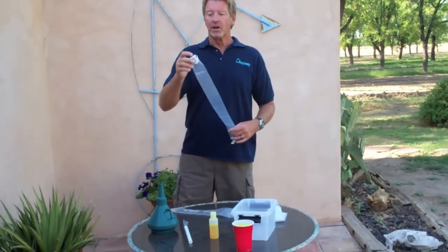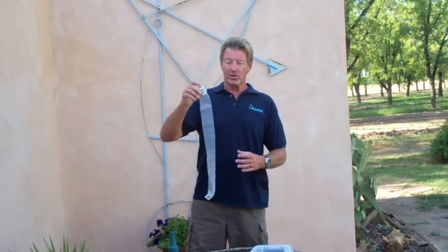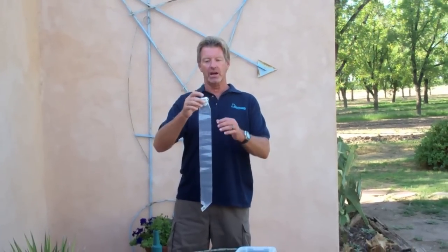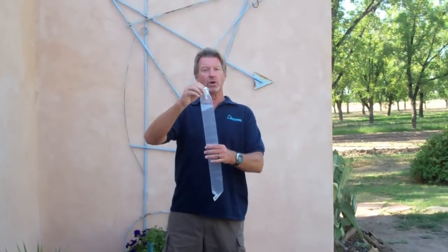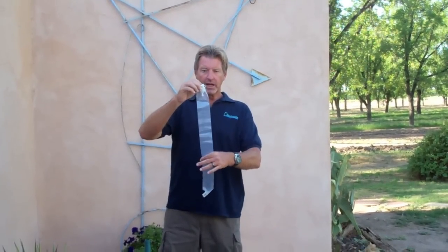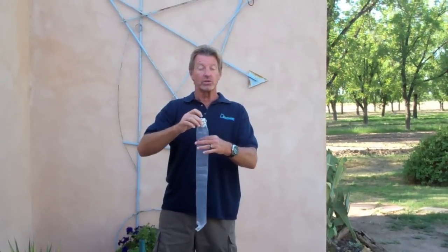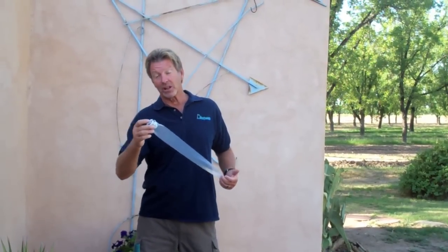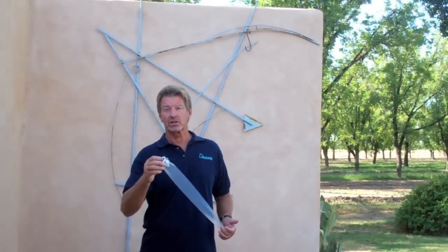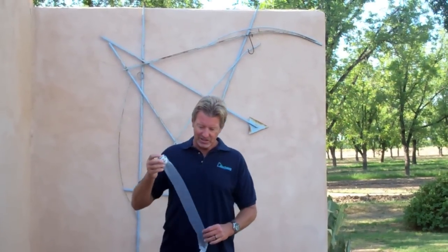As the product evolved, we discovered that this check valve was a little crude. The hydrosleeve was cycled up and down in the well screen. When it moved up, the check valve would open and water would flow in. When we lowered it again, it would close, and we literally pumped the hydrosleeve up out of the well screen. We found that this particular check valve took a lot of pressure to open, it filled slowly, and had a lot of other disadvantages.